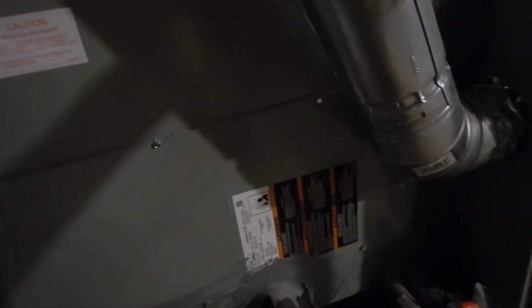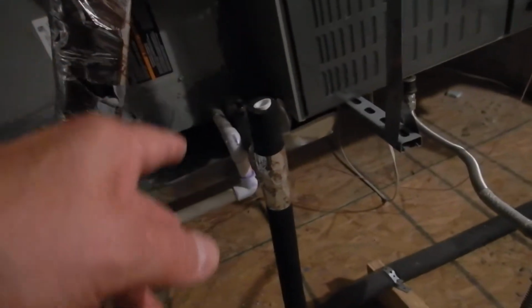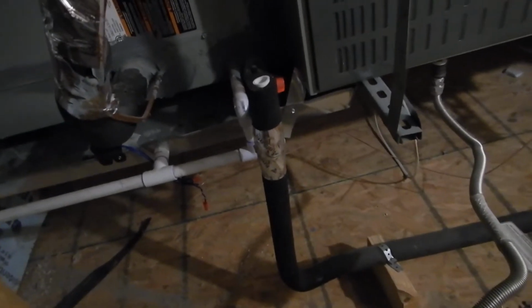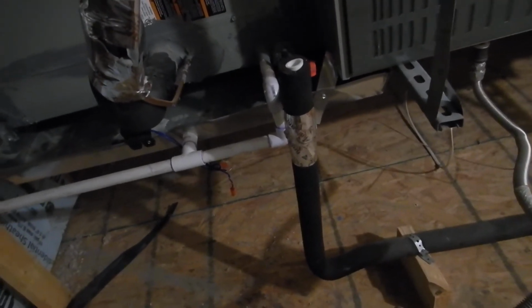This is the evaporator coil. This is the second half of your air conditioning system. Condensing unit video will be following. What's going on with this one is that we have an insulated P-trap for our primary drain line. That's a shallow trap. And some manufacturers don't like a shallow trap. The trap should actually be deeper than that. And I happen to agree with that school of thought.